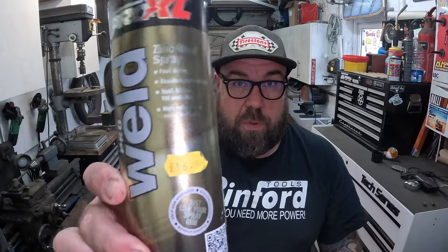Back to the work. We'll pick up where we left off, which was we just boxed in the underside of the chassis. So the next step is to put the frame head on. You know the drill by now. Weld through primer, plonk the two bits together, weld it all together. So let's get going with some of this stuff and build a beach buggy.